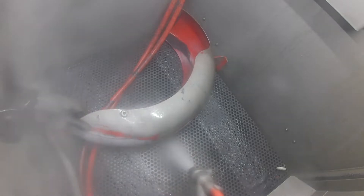If you are using it to prep for another coat of paint, a straight fine aluminum oxide will do the job perfectly for you. If you are looking to remove the paint and have a polished surface finish to keep bare, a fine glass bead and fine aluminum oxide mix will do the trick.